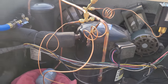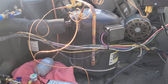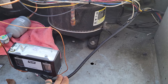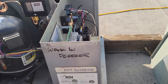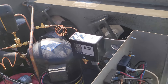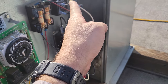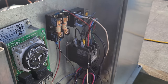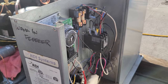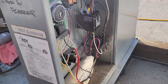Evacuation's about 467–466 microns. We've got power turned on so it's pulling through the entire system. The wiring on this is a disaster — it gives me anxiety, but it is what it is. We'll make sure we secure stuff so it doesn't rub out. We've got dual pressure control — the fan cycle switch turns that fan motor on and off, and this one will run 24/7. We've got power from the pressure control coming from line three, going through the dual pressure control, coming out, going into a time delay — an anti-short cycle timer. Then coming out of that, going to the contactor coil. The other side of the contactor coil is wired energized all the time, so if it ever ran low again it wouldn't do the on-off, on-off. It's a 180-second, three-minute timer.